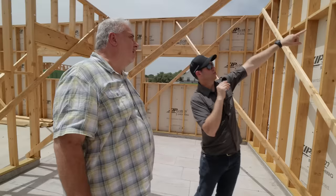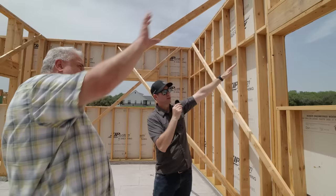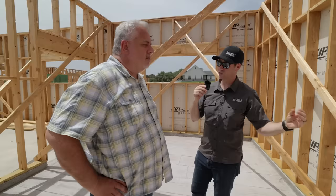We've got a solid header there — looks like a two-by-ten — and you've got a top plate and a plate underneath it. Those do have insulation packed inside too; there's a two-inch piece of insulation. But if you didn't have insulation there, that's another place with very low insulation compared to the cavities. When this gets installed, we still get shear value out of the zip sheathing because it's sandwiched in between. We're probably going to use a slightly longer nail — about an inch-and-a-half embedment is typically what we're in search of.